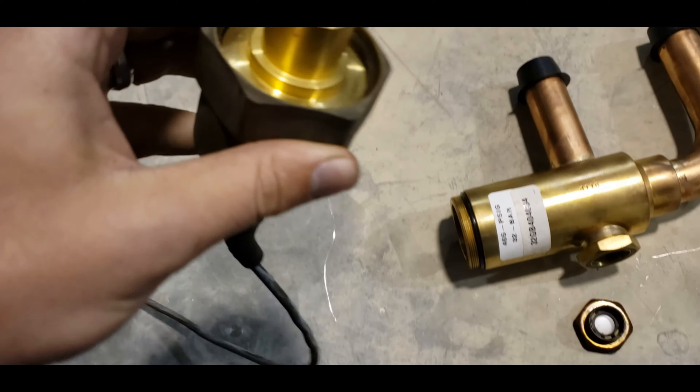Just so you do know, if there is ever a problem with the motor or with this connection here — I know it looks like it will come apart — but all this is all part of the refrigerant and the system, so you are not able to take this loose without recovering things down. And that's your overall basics — not a whole lot to it. A critical thing on a rebuild is you want to make sure that the inside is really clean, you don't have any trash. You can see the actual plunger piece sitting down in there.